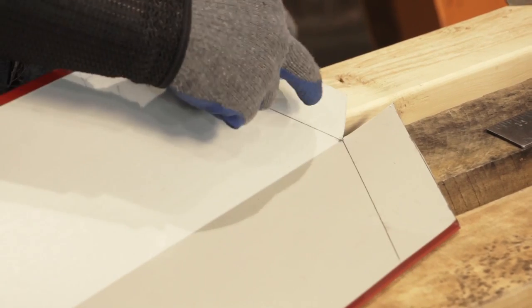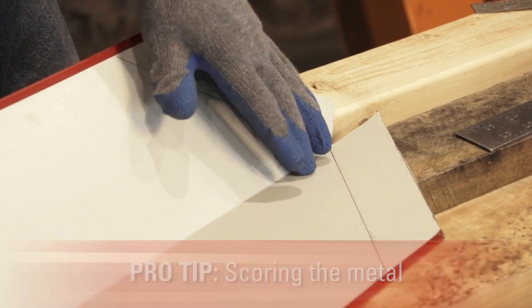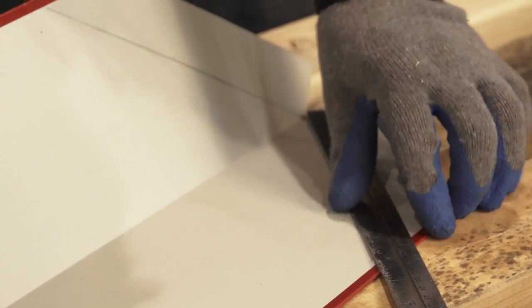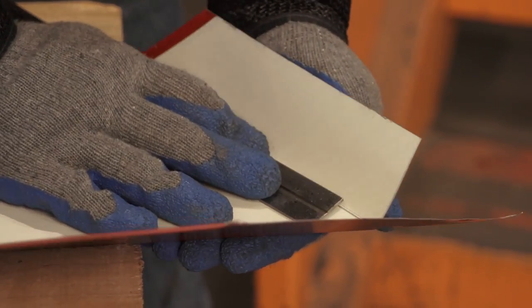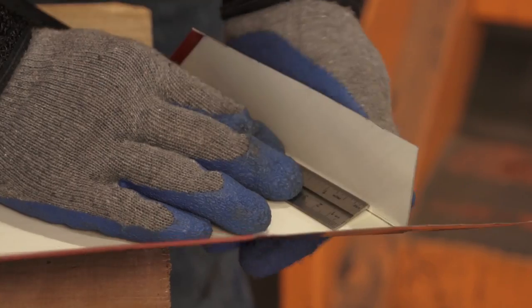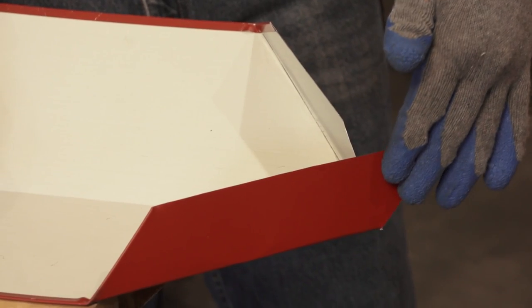Now we have to fold these two tabs — they're two inches long, which means they're longer than the depth of our hand bender. So a tip if you want a crisp bend: you can gently score the metal using a razor blade. I'm very, very gently scoring the metal — if I score it too much the paint's going to crack on the other side, so I'm just doing a quick pass or two. Now that this has been scored, I can bend it by hand, using my straight edge as a guide and placing the heel of my hand underneath. The score in the metal helps make for a very crisp bend, and this longer piece I'll be able to fold across.